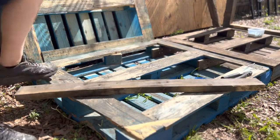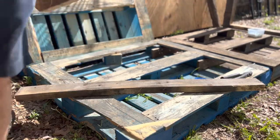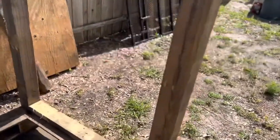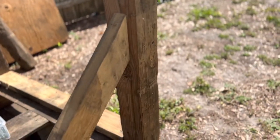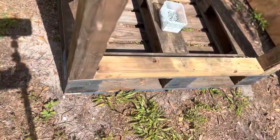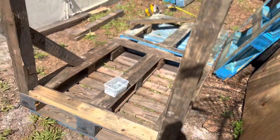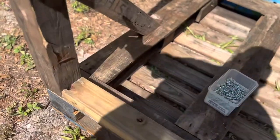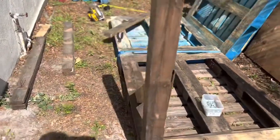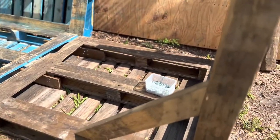What I did is I cut this diagonal board for a brace, and I'll show you where that's going to go — just like this. That's your brace, and it's up real good on the end. There's a 6-inch screw that goes from here through to that board. If I need more support, we'll just add another cross member from here down that way, but I don't think we're going to need to. I'm going to go ahead and cut all four of these braces now.